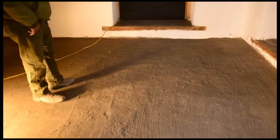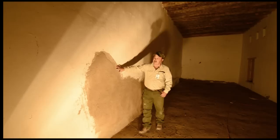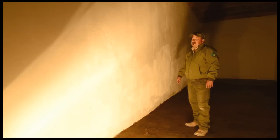Here we have a patch that covered a crack and we used the same plaster as the third coat. We completely sealed the floor here — you can't see the patch anymore. We also sealed it with Thompson linseed oil sealer. Here we've already done the three coats — the first, second and third — and it's ready for the whitewash. We do this section first and then come back and do the complete wall. As you can see, we completed the whitewash and you can hardly see the patch that was here, and we went on and finished the complete room.